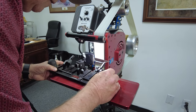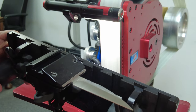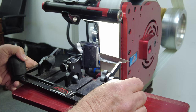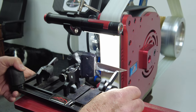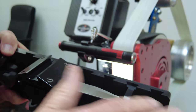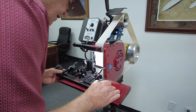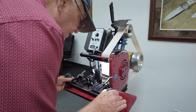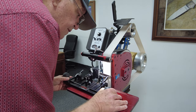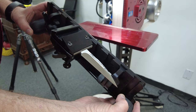My thickness of blade is going to be a little thick at the bottom, but what I do there is turn back into it. That one's from the 220 to this 800, or whatever it is — it's 30 micron. One pass. It's not hot enough that you can't rub your hand over it. We just finished with the 30 micron. I will go to a 15, then a 9, and then to the buffer. So we will have used 5 belts. This again is a 15 micron, which is about 1200 grit.